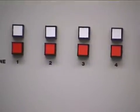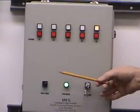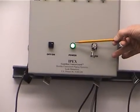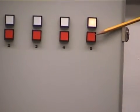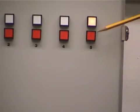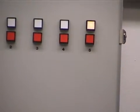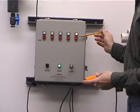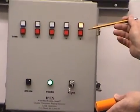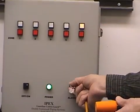I'll close the panel and power it up. You can see right now we have the green light showing that we have power coming into the panel. Right now the white light is lit brightly and the red light is not lit. This indicates that this zone is functioning properly. I'm going to grab a sensor that we have hooked up right now and use my finger to put it into an alarm. As I trigger the sensor, the red light comes on, the white light dims, as well as the horn goes off. I'm going to turn the horn off now.